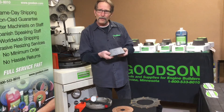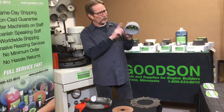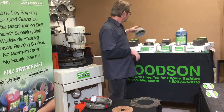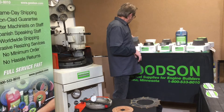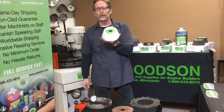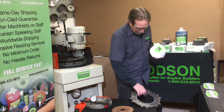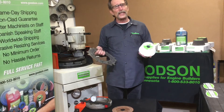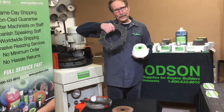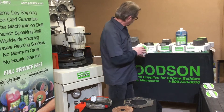We use the FGW 65 — this salt-and-pepper wheel is a good wheel. It grinds really fast, it's very aggressive, and gives you a long life. When you get into cast steel or billet steel, it has aluminum oxide as well as silicon carbide in it. Some customers prefer the sugar white wheel — all aluminum oxide — for billet steel. A lot of alcohol dragster and pro stock guys use that sugar white wheel for grinding their floaters.